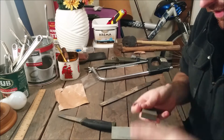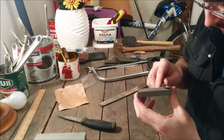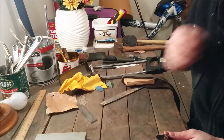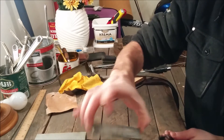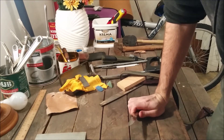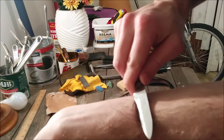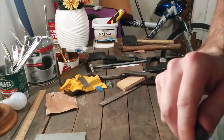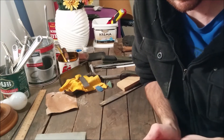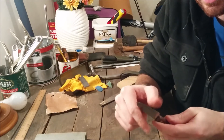Starting to cut paper a little bit. I finished putting an edge on here — my bench gets messier and messier. I went and did a few passes on my diamond sharpener and then used a strop on it, and it's now razor sharp. On YouTube, everyone has to cut hairs with it — and there we go, I can cut hairs with it pretty easily. It's not that hard to get a knife to be able to take your hairs off like that. Basically, when you strop it, that's when you get that razor edge.